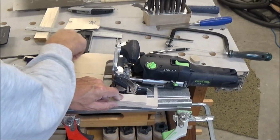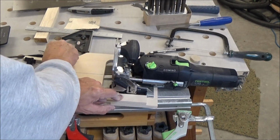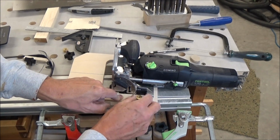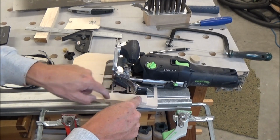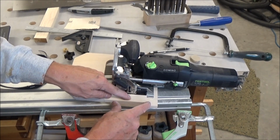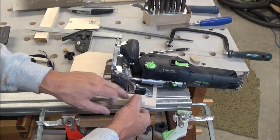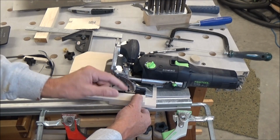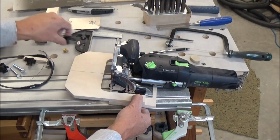Okay, I'm going to use these. My first thought was to use these as a knob, but they're too big. So I'm going to use these thumb wheels. They should work fine. I'm going to drill my hole a 1/2 inch from this end and then 2 inches on center, going this way. And that way, when I build my spacers, and I'm going to use solid wood spacers in here to give this a positive registration, rather than bushings or something like that. I think that'll work out a lot better.